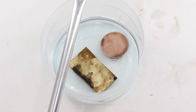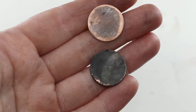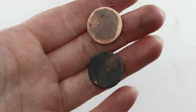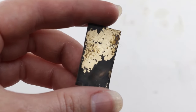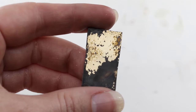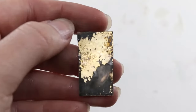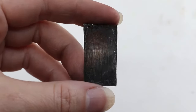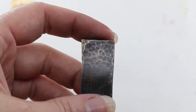Next I decided to submerge the metals to get a more even finish. These are the backs of them, so you can see they are not darkening evenly in the clip — that's because they weren't cleaned on the backs. The front of the copper one turned out pretty good: a nice, even, dark black finish. The brass, however, did not turn out great, probably because the metal wasn't cleaned enough or was left in the solution too long. I'm including this to show obstacles you might encounter. I cleaned the metal up, tried it again, and it turned out just fine with a nice, even black finish.